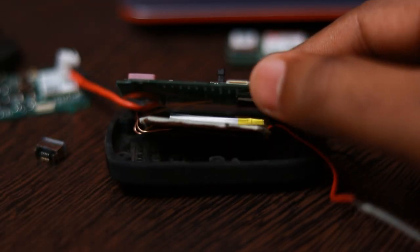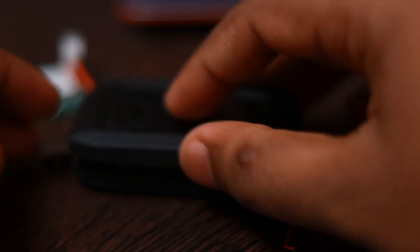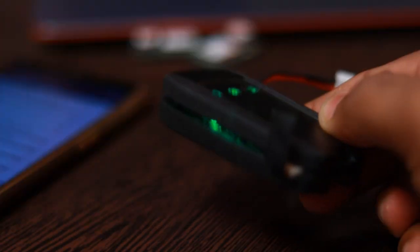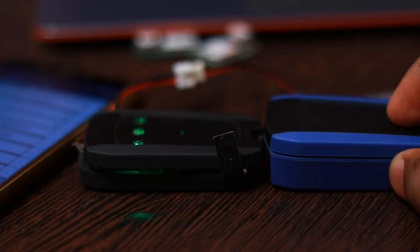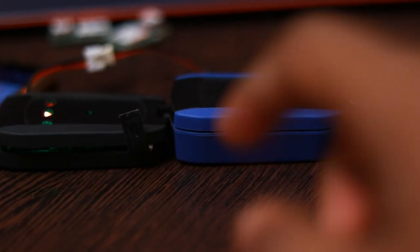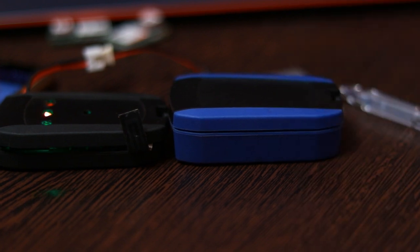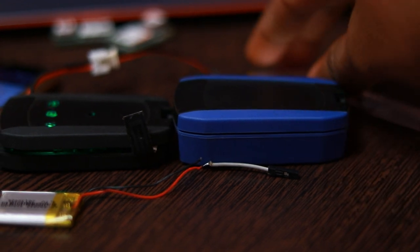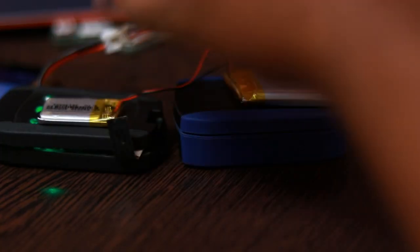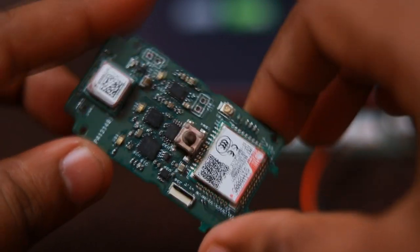This is how the PCB, the charging coil, and the battery will fit into the enclosure. So far it has been a perfect fit and it's a first iteration. In this enclosure I have added a 350 mAh battery because that's the size possible to fit into this enclosure. For a higher capacity battery up to 750 mAh, it's possible to be accommodated in a slightly bigger enclosure with the same form factor but increased height. If you want to know how long these battery configurations would last, check out my previous video on the tiny pad tracker V2MF, which sets the foundation for the technical specs present in this design.